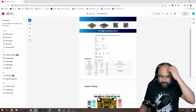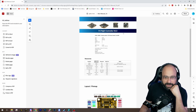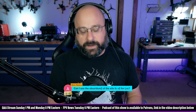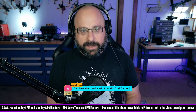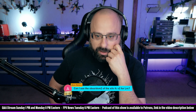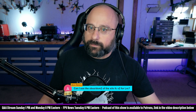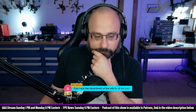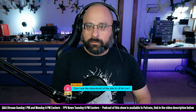DSM-2 is TX-1, so that's not going to work. Your workaround will either be to put the ExpressLRS receiver and configure it to output SBUS — in which case it'll go to the SBUS pad — or configure it to output inverted Crossfire and put it on the SBUS pad. Either one of those will work, but you will not get telemetry. And if the DSM-2 pad happens to be on the same UART, you could solder the other wire to the DSM-2 pad, because it's a TX.